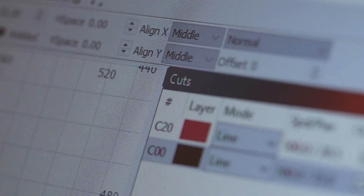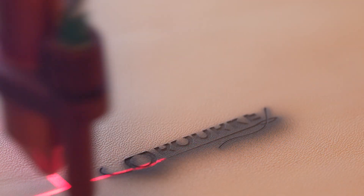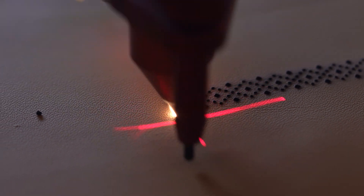Join me over at the laser cutter now. To start with we just run a few different tests — we'll run the logo here for a bit of fun. This enables us to get the speed and the power right for the type of leather being used. Once we've got that, we can load up the file for the Lamborghini strips and the machine will do the engraving and then cut the strip out, ready to be cleaned and then stitched into the seat cover.